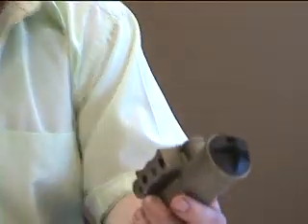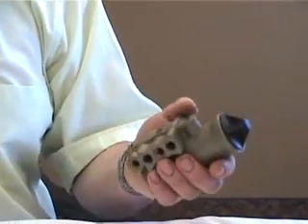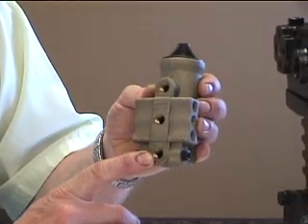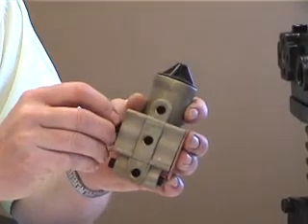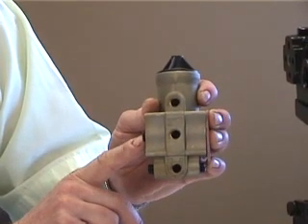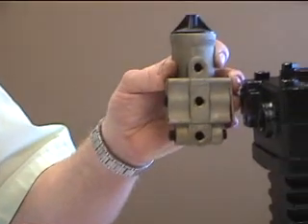The only thing that would be in there is the gasket, so that the air can flow through your governor and into the unloader of your air compressor. So what are we going to do with the rest of these orifices? We're going to leave this one open with our gasket sealing it. We're going to have to plug this one and one on this side. This port stays open because a line will go down to the tank. This one will be sealed by the gasket. You'll probably end up plugging this one between the two bolts that hold your governor to your compressor. This one stays open — it'll go back down to your air dryer. So: this goes to the dryer, this goes to the wet tank, and we mount it onto our air compressor.